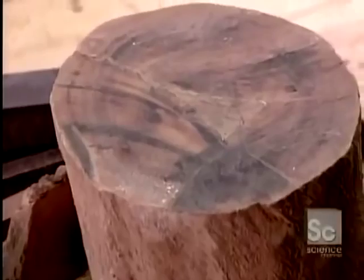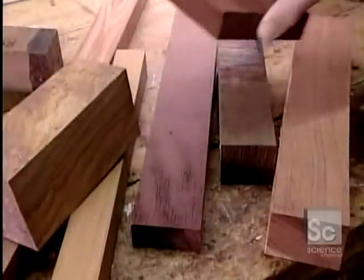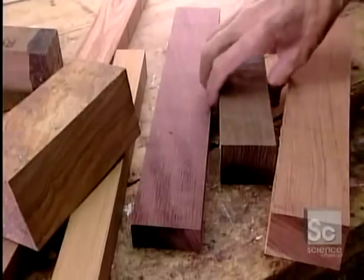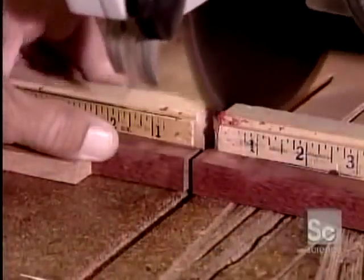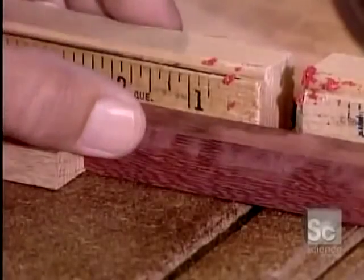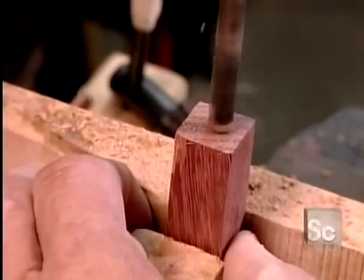This artisan uses some 50 different kinds of wood, ranging from domestic maple and oak to imported rosewood, ebony, olive wood, and purple heart. When using just one type of wood, he runs the block through a band saw, cutting a strip six-tenths of an inch wide, then with a radial saw cuts that strip into two pieces each about two inches long — these become the pen's top and bottom casings.